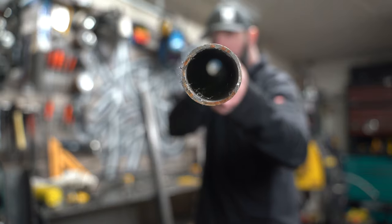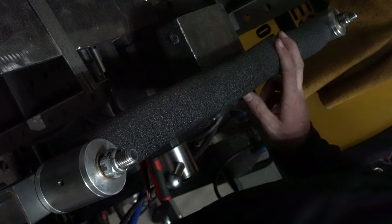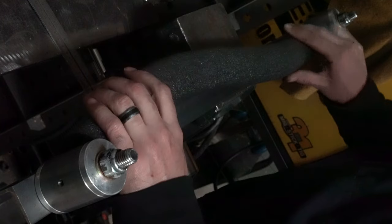With the bar ends locked into place, we've got all kinds of options for the link bar itself. You can use round tubing or square tubing — you can put square tubing in angled to create a diamond. You can use a straight piece of tubing, tubing with a curve or an S-shape, or even build a link bar out of plate. Assuming it's structurally sound and the bar ends are positioned properly, it doesn't matter what shape the link bar is. It also doesn't matter what the link bar is made out of as long as it doesn't bend or break. I prefer mild steel or DOM tubing. I've been told I should be using chromoly, but I don't, mostly because I don't understand the topic fully — and not because I haven't tried. I have literally spent days researching the mild steel versus chromoly debate, and I can't find a group of smart people that agree.